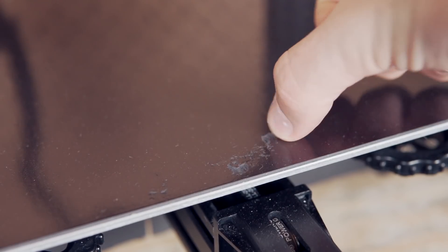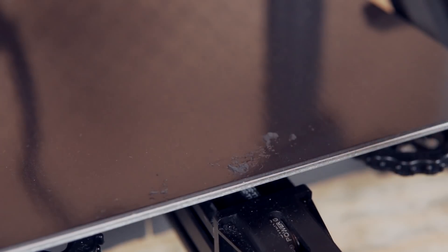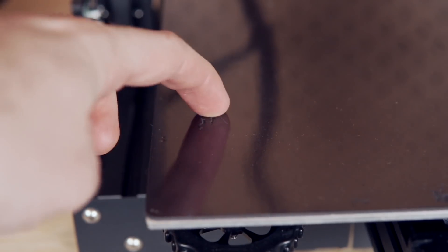The last issue is with the powder-coated PEI flex plate system. The PEI spring steel itself is solid — it's actually thicker than what a lot of flex plates are that come with these budget 3D printers. The issue I ran into was with the magnetic sheet itself. Around the time I was printing ABS, I noticed little pieces of the magnet getting stuck to the PEI, and when I pulled it up, it was actually taking some of the magnet with it. Considering I've only had this machine for a few months and it hasn't been in a heavy print environment, I don't feel this should be happening so quickly — the main issue is they went with a really low-cost magnet.